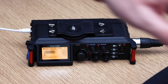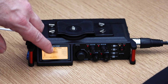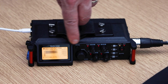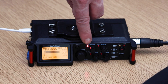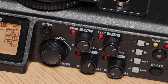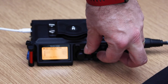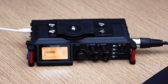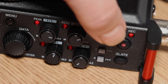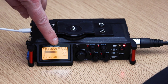It's receiving the audio straight from the actual mixer desk. You can see my audio levels coming up and down just here, which are very good. So long as that audio level stays around that point — there's a marker there to help you — then you know you're getting audio. You have to be aware of when it peaks because you'll see a flashlight indicator there, and if that is on all the time you know you're getting a very high level, so you don't want that. You can adjust the audio level and bring it right down, and in fact you can mute it altogether so there's no recording whatsoever. I'm going to bring it back up to a reasonable level. Once you've got your desk all sorted out and you're ready to start recording, literally you just press the record button. You get the full red light on there and now it is recording. You can see the amount of seconds trundling past just there as well.